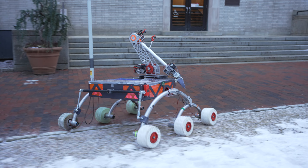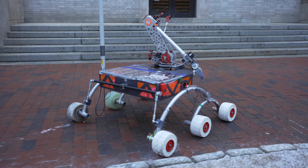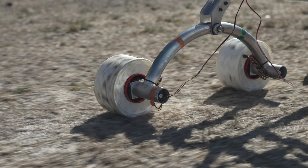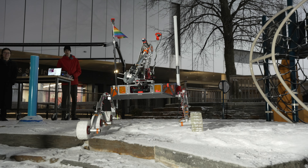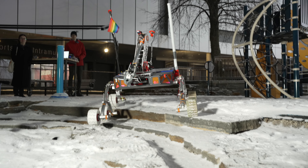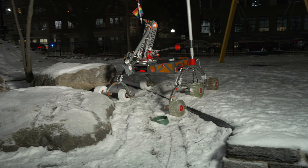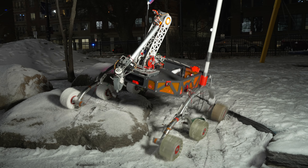To refine our tried and true 3D printed wheels, we've added fatigue testing and thermal modeling to our existing static FEA. Our wheels are printed out of TPU on low-cost FDM printers, enabling a fast design cycle and extensive physical testing. Our curved spoke design is flexible enough to easily traverse rough terrain and durable enough to support our rover through many miles of driving.